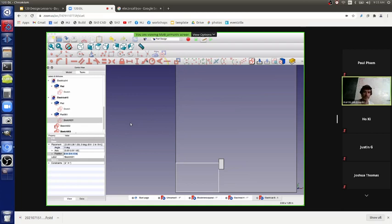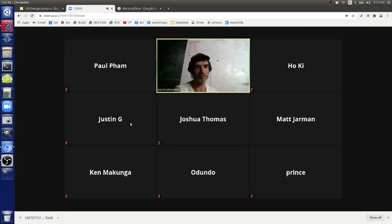So we just found out that the electrical junction boxes are not going to be in the center because there's no studs there. They're going to be off to one side or another. Now, can you put this on the other side of the stud? Yeah, sure. But let's make everything uniform.